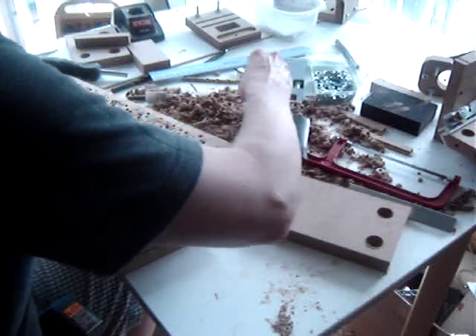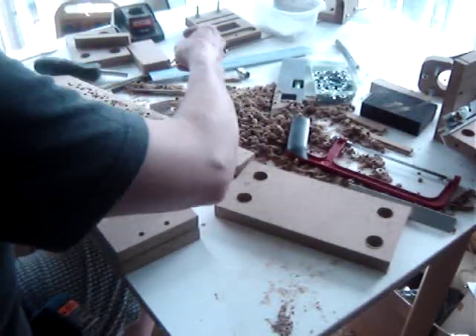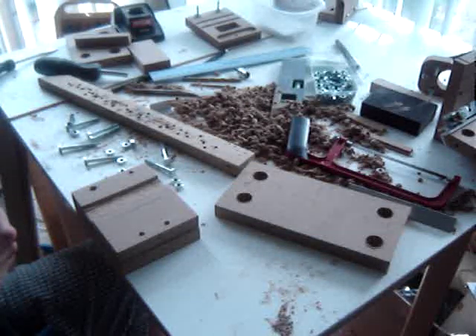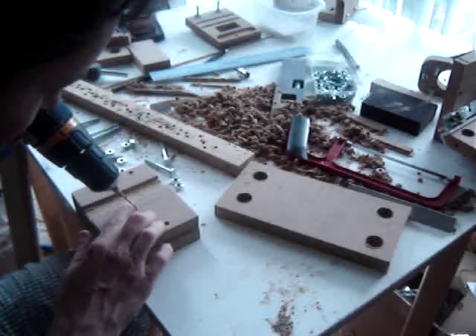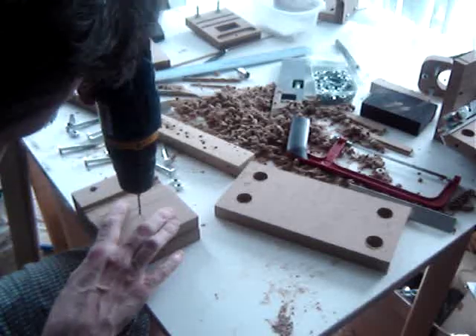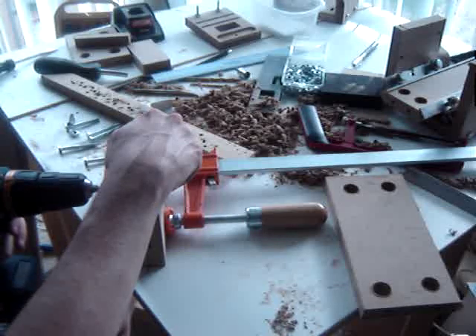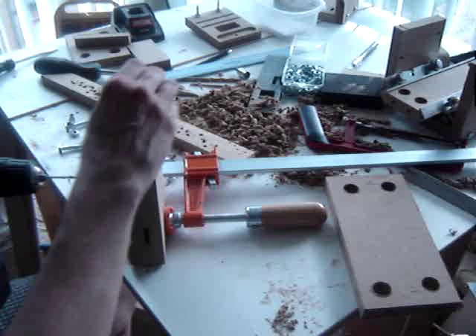It's difficult finding a bit when the place gets a little bit messy. Drill a pilot hole. Clamp it together and drill all the way through — this will keep a good alignment.